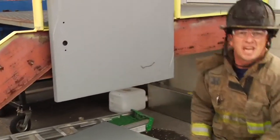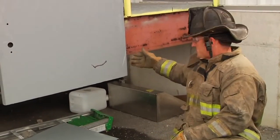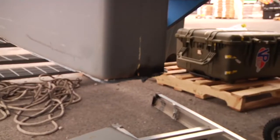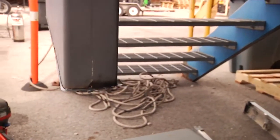As you can see, as I came across, I stayed deep in the cut all the way across, and I really stayed in the back side of this cut to make sure I cut through the jamb. If you don't, you're gonna leave hangers there and the door is not gonna come. From here, I can inspect the inside and see what I'm up against and try and defeat it after that.